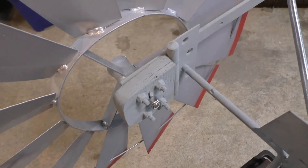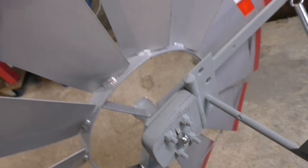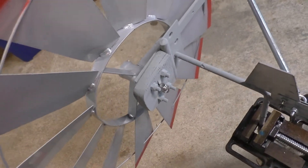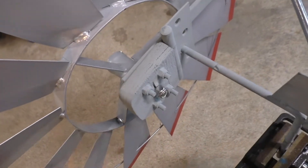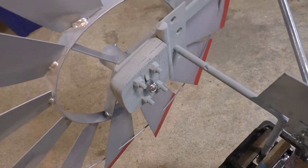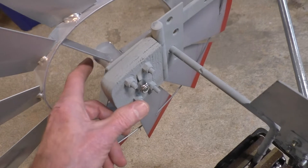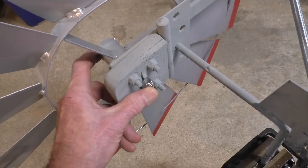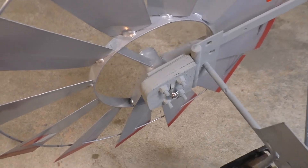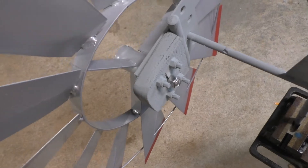To do that, I found it necessary to make up a block of wood to hold the shaft of the rotor — which is a 3/8-inch bolt — in place, so I don't get any severe lateral movement that I would get without the block. The block of wood keeps the bolt essentially horizontal, and at the same time eliminates compression forces on the bearings which would slow them down and add resistance. This results in having the rotor run free.